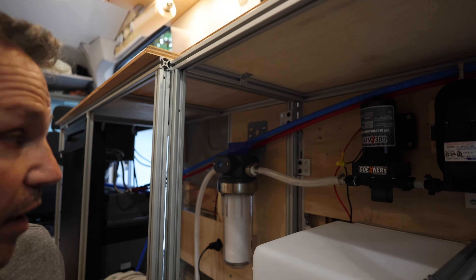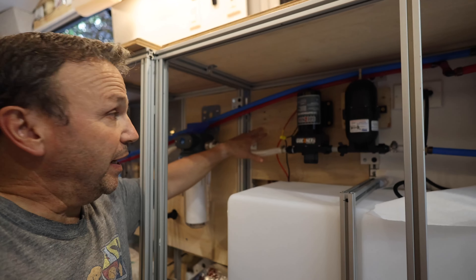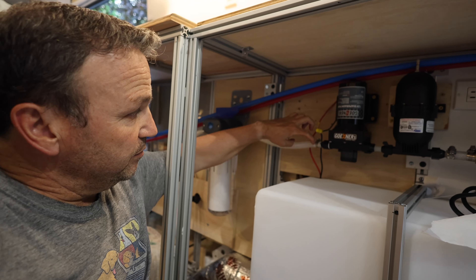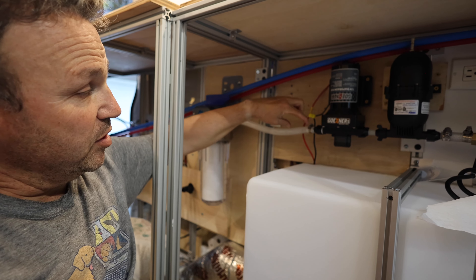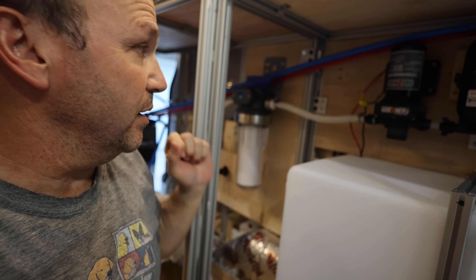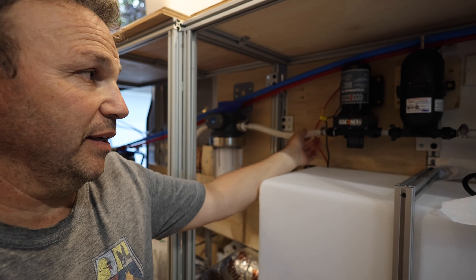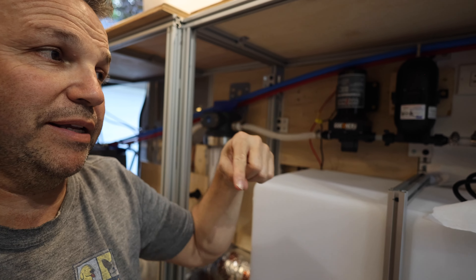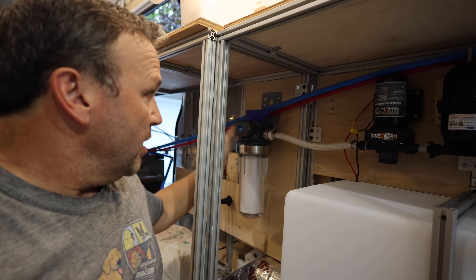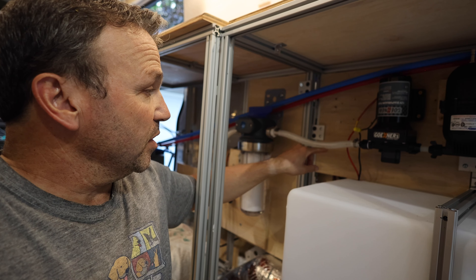Over here I have a water filter. I'm going to move it back because I had the wrong connector — I was using a regular PEX connector and it was causing the hose to bind. The PEX connector in the back was too small and was letting air in, so it was like drinking with a broken straw — just sucking air and not getting pressurized. I'll put a new fitting on after retesting to fit this hose better.